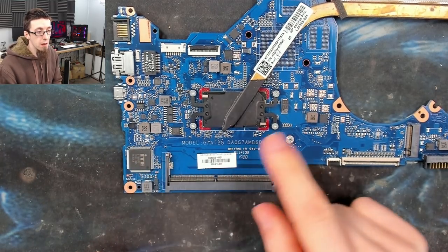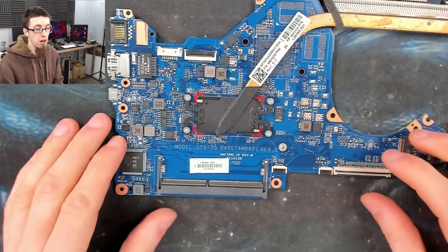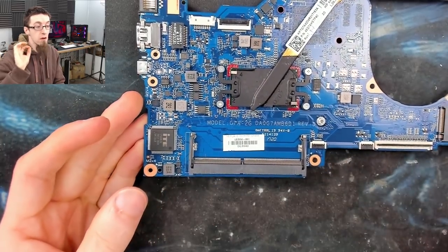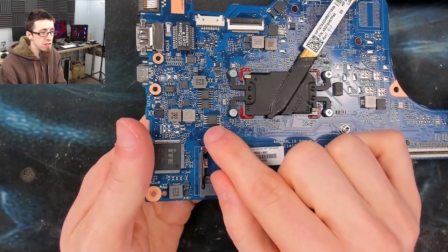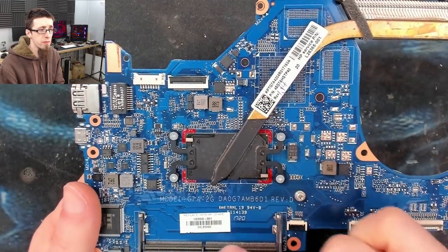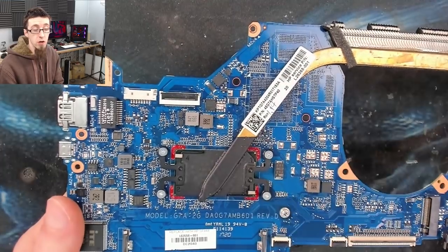That leaves our BIOS chip being this dude here. The indicators that make this the BIOS chip: it's got a square box around it — highlighted as "here is the important chip." Also, as you can see, we've got a SOP8 package. The two types you'll commonly see are the SOP8 or a WSON8, which looks similar — a flat package with eight legs. I know it's this one and not the others because those are all MOSFETs sitting on big power traces. It's all power stuff; it's not going to be your BIOS chip.